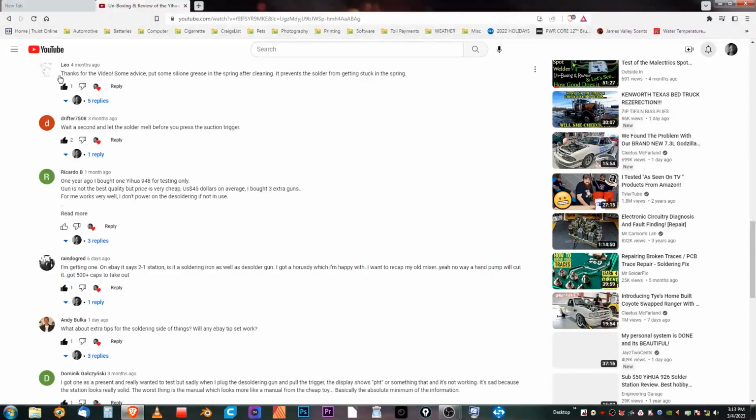And the first comment that I got a lot of help out of was from Leo. He said, thanks for the video. Some advice: put some silicone grease in the spring after cleaning, and it prevents the solder from getting stuck in the spring. And I was like, oh my goodness, that sounds like an incredible idea. We're going to be doing that in this video, and we're going to see how well it works.